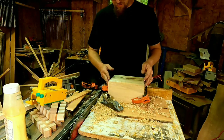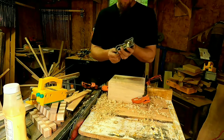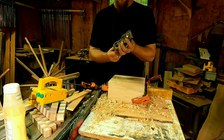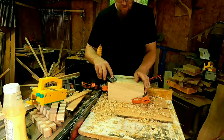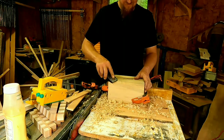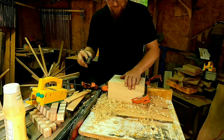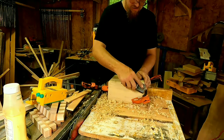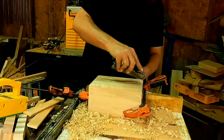Now that we have our roundover done with the second smoothing, we're going to lower the blade even a little bit more — she's barely doing anything. We're going to go after it one more time, and this time I'm going to go with a little more rotation with an angled cut. I'm barely getting anything — that's looking really good, guys. This worked really well to just go like that, follow the curve.